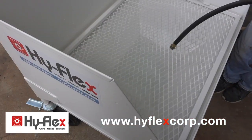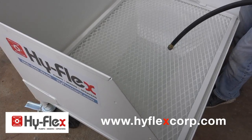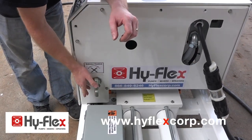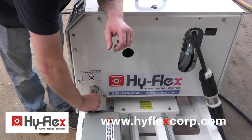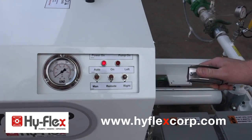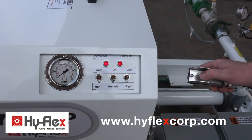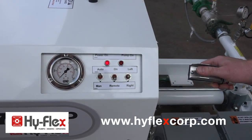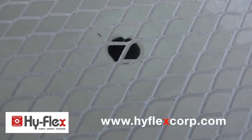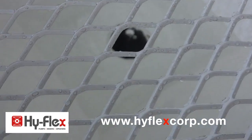Fill the hopper with approximately 15 gallons of water. Close the volume control valve and open a half turn. Turn on the main disconnect. Place the toggle switches in auto and remote. Verify the remote switch is operational. The pump is now pumping water. Introduce properly mixed material.